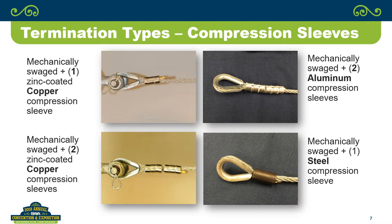I did a fair amount of research though, and there's a lot of wire that is used in sailboats and marine and everything else. What's interesting is that even though the theory tells you that in a highly salt atmosphere this is not going to be good for galvanic corrosion, they take stuff that's been in service for 10 years, they tear it apart and don't really see the results that the theory would tell you you should see. Doesn't mean that you should discount that, but it seems in practice it's not as bad as what the theory tells us it should be.